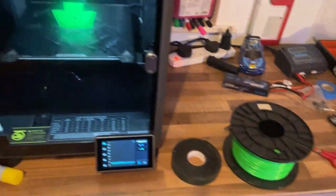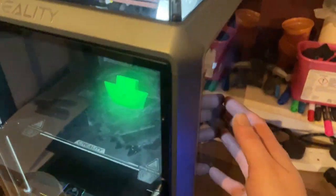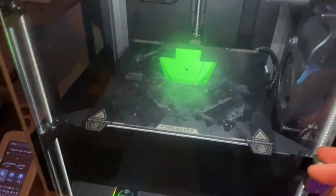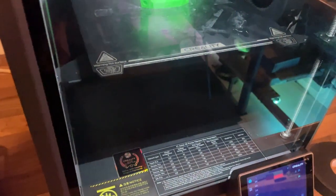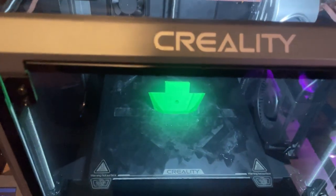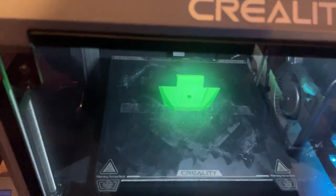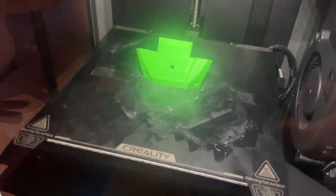So I'll show you how it's done. The first thing you need is a 3D printer that's got an enclosure - this keeps it warm and stops ABS filament from warping. This procedure only works with ABS, so this is very important. If you don't have one with an enclosure, chances are you're going to have warping prints and in some cases they can actually pop off the print bed.